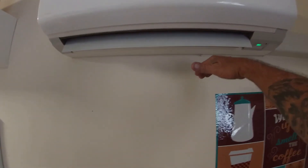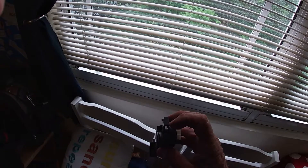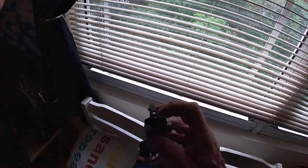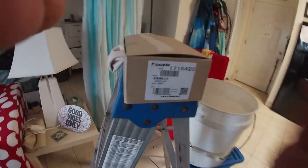You can hear the air — that feels good, nice airflow — so we are working. Here is that gear assembly, the reducer gear. These things start to strip out with the weight. It starts to open — I think it's like halfway or so — one of the guys I work with marked it and watched it one day, and you can see it comes open halfway, hits that, and then starts to close. That's how it's an air proving switch, pretty much. This just plugs in right underneath it. You got to get to this little clip right there — you fight it sometimes. Right there is the part number.